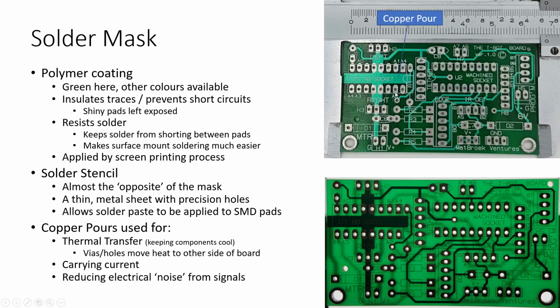Something to note about this board is that, for instance, on our DIP package right here, for our motor driver chip, pin 1 is identified by having a different pad shape than all the rest of the pads in that DIP chip. And here we can see for chip number 2, it's also got a different pad shape on number 1.